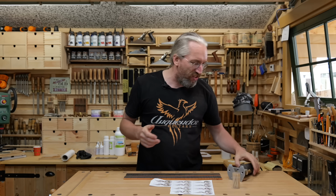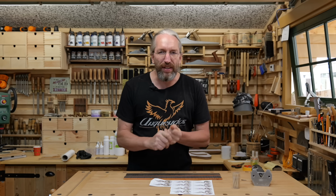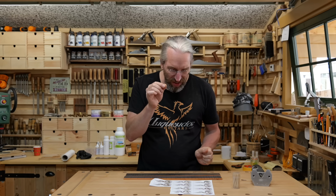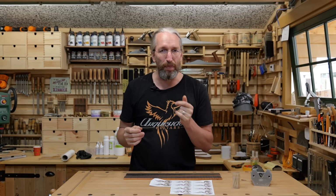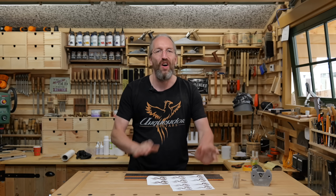Stick it to the fretboard using masking tape and super glue, cut it out, and at that stage there's nothing left to do but use the Dremel again and route the cavities. But for the slightly smaller inlay, for the very tight spots and the very small points, I'm going to use an even smaller router bit, one I have saved especially for these two inlays. So let me set up the camera in a different angle and start laying out the inlay on these two fretboards.